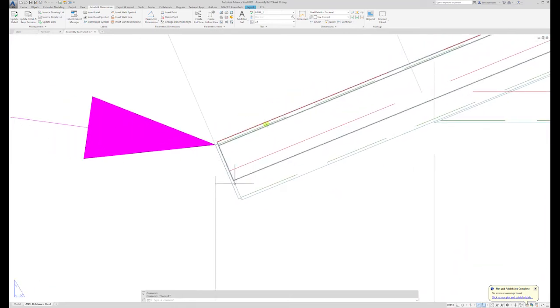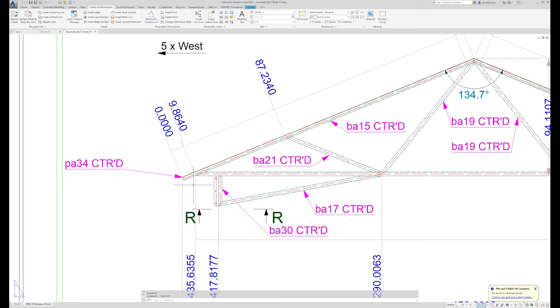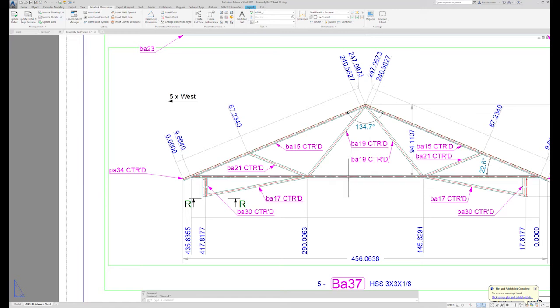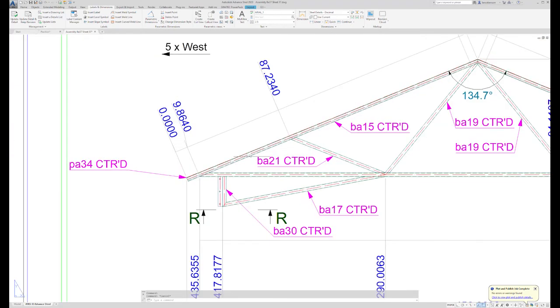This is an end cap that encloses the end of this tube. End caps are the very first thing that we put on our single parts in the shop. So you have a bunch of components, you put all your end caps on, because it's the easiest time to do it, because they're easy to flip, rotate, and grind, and so forth. You don't want to be grinding the ends of this tube when you have a great big truss that is hard to flip over and get to different portions. We can weld in the flat position, roll your tube, weld again, roll your tube, weld again, roll your tube. It's very simple when it's just on a single tube rather than trying to do it later. So end caps are always first.